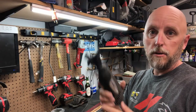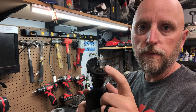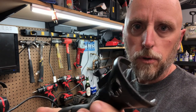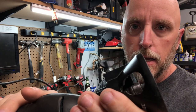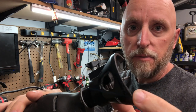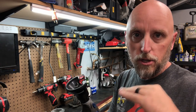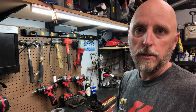Let's get to it. I'm going to be using my Dremel with my 106 bit in it to finish carving out these stars. Now what I did also is I have this adjustable depth gauge on my Dremel, and I have the bit set so it just barely extends beyond the bottom of the depth gauge, maybe like a 16th of an inch, if that, maybe even a 32nd, just to take off the top layer of the wood and get the stars carved out. See how this works.